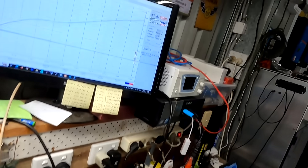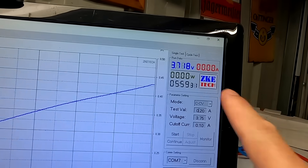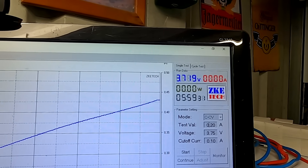Who knows how long it will take to discharge a battery with 1C? Yeah — around one hour. I've already prepared our battery; we are charged to 3.719 volts, but I want to bump up this cell to 3.95 volts, absorb down to 0.1 amps so the battery is fully charged, and then we can do the 1C discharge test.